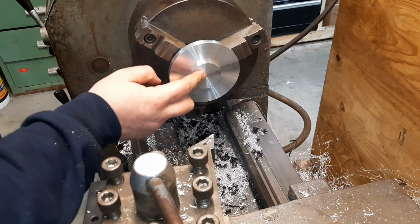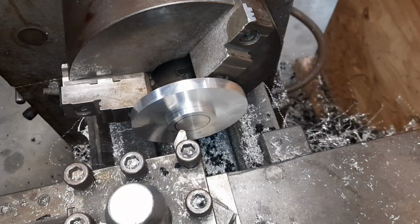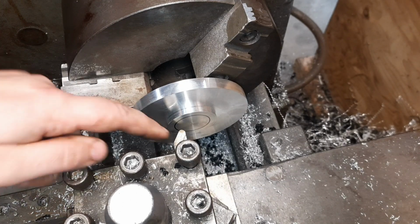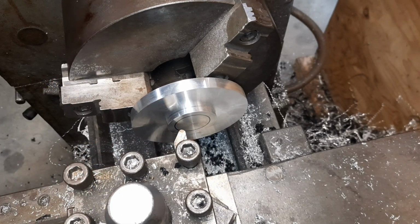Now let's go into our brain and figure out exactly what we want to do for this here chamber. All right, I have my squish band marked, and this is just a quick and dirty way to do it. Got a nice radius cutter ground on here, and we're going to scoop this material out. And I'll take it out and I'll actually CC it.